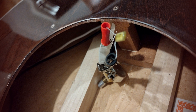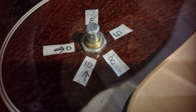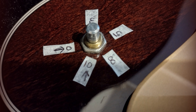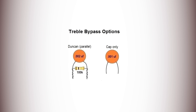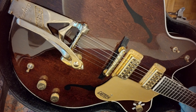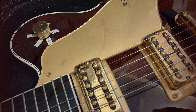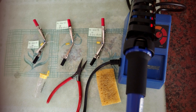I've also recorded some examples where I started with the treble bleed capacitor installed and then pulled the crocodile clips out, so you can hear the contrast between having and not having the treble bleed. For that purpose I've pulled the volume back a little bit — roughly to about eight — and then compared with the treble bleed and without. That way hopefully you'll hear a pronounced difference. The reason I've done this is because my preferred attenuation when I play that guitar is just to knock the volume back a little bit, where I want a little less volume but I don't want the tone to change quite so much. I've done that with all four capacitor and resistor combinations.